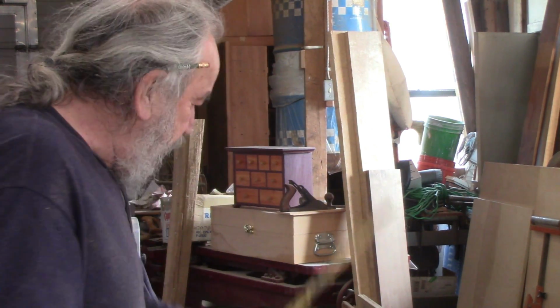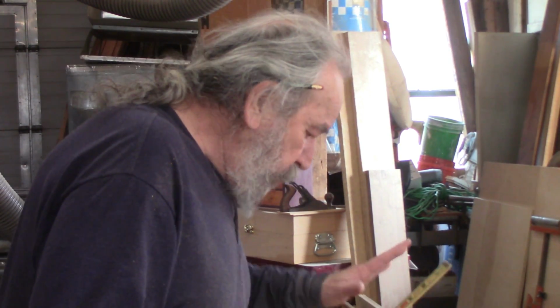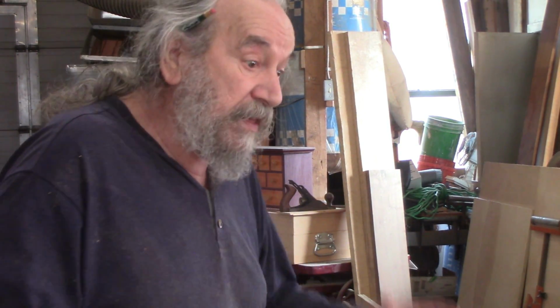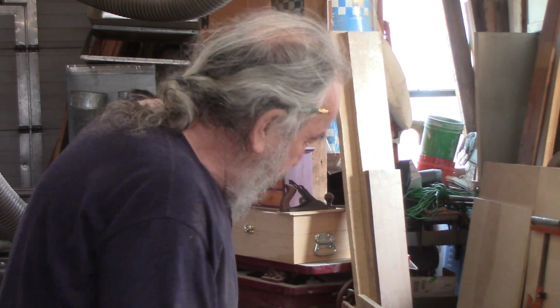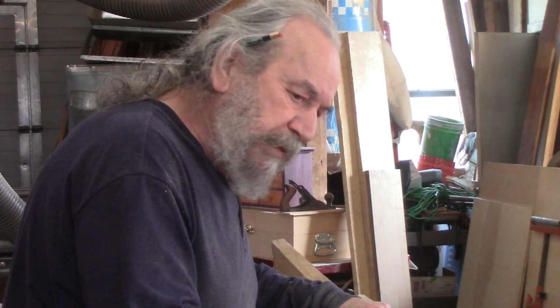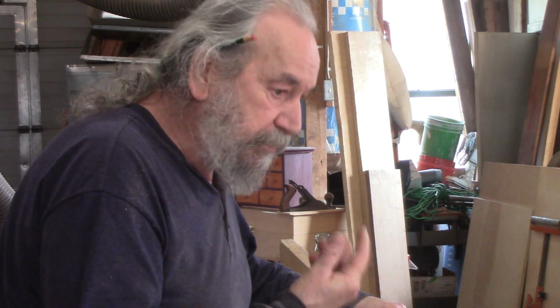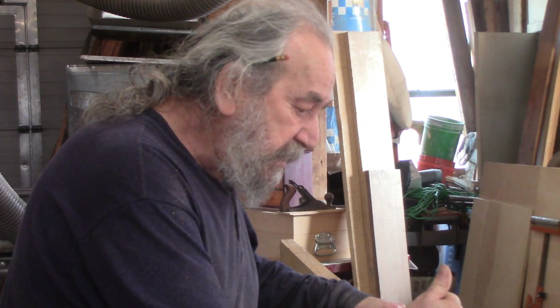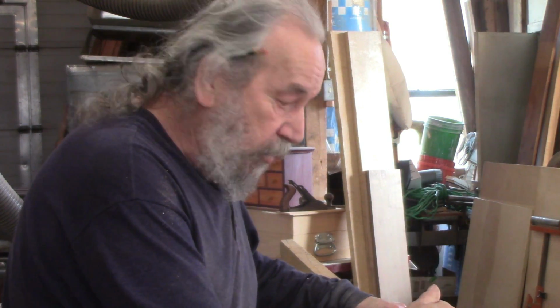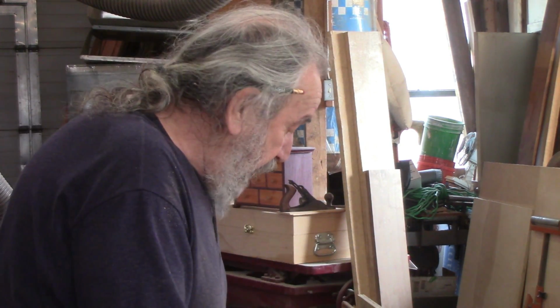So it's great. I've got 2 pieces left over. Actually, I've got 4, but I pulled out 2. One I'm going to cut into all of the sides, and the other I'm going to cut into the backs. I need much less back material than sides, so that's easy. The sides, 6/4 isn't quite enough for me to split into 4 1/4 inch pieces. I know that doesn't make a lot of sense, but you do the math out. Then it's not the material, it's the planing the surface and the saw kerfs. So they're not going to come out 1/4 inch, they're going to come out more like 3/16.